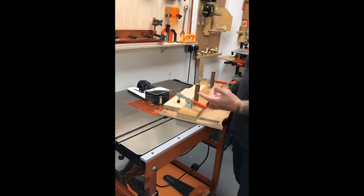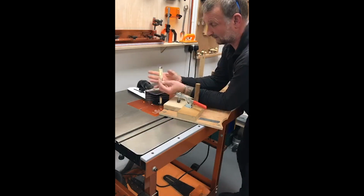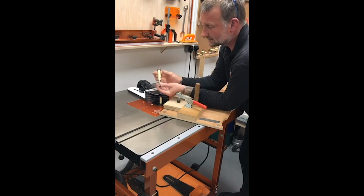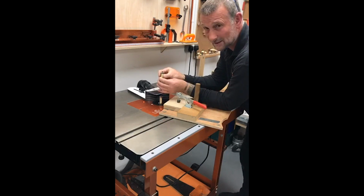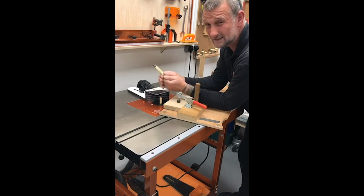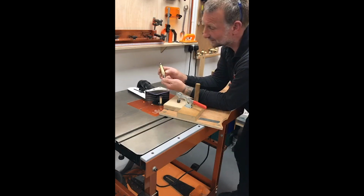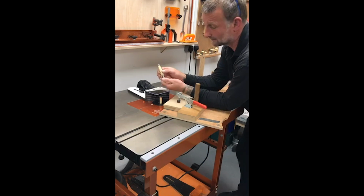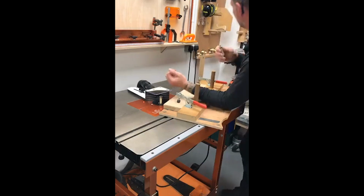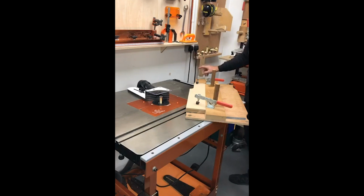Cutter speed is really important. It looks like quite a big cutter, doesn't it? It's physically large, it's long, it's a half-inch shank, it's quite heavy. But because it's a relatively small diameter cut, we can run this really fast, up to 24,000 RPM for this particular cutter. Its cutter diameter, as we've said in previous videos, denotes how fast you can run that cutter. All the information is always on the shank. It has to be there. I've checked that. We are there at 24,000. Extraction on.